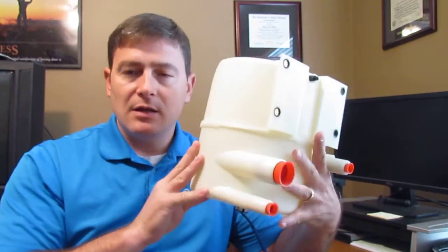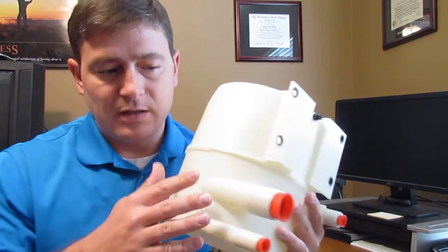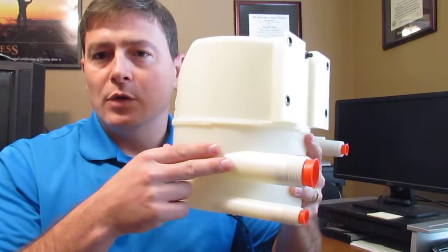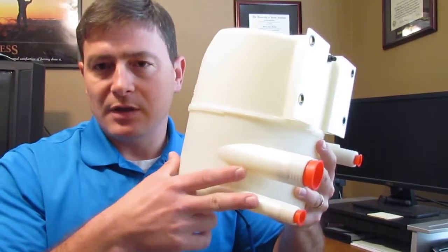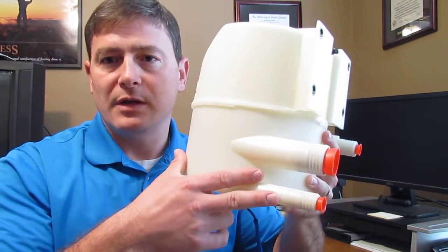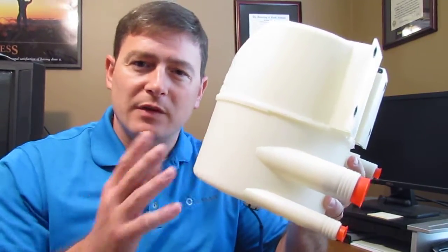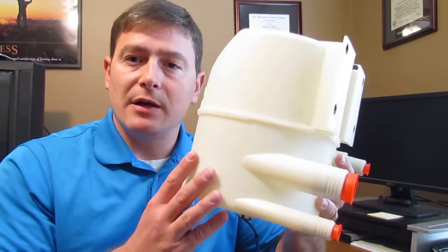This particular unit was specifically designed for a fan drive system. You'll see in this case two suctions — the top suction would traditionally be used for the fan drive pump and the bottom suction would be used for a steering pump. You'll also see these used in mobile systems that don't really have a lot of hydraulics but maybe they have hydraulic steering on them.